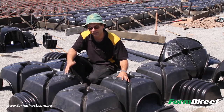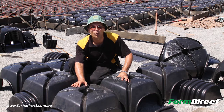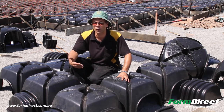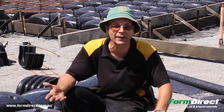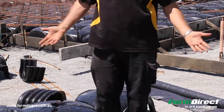There are other benefits: it's not porous, so it reduces shrinkage. It can stay on site for a month or two months without any erosion or brittleness. It's a recyclable product and doesn't blow away in the wind. A concreter can set up the Cuplex without putting the mesh on, come back the next day and still have all the Cuplex in the right spot — which is very hard to do with waffle pods. There's no waste, no going around picking out polystyrene balls — very minimal waste. The only time you cut is where you've got penetrations. That's a quick rundown on the Cuplex system.